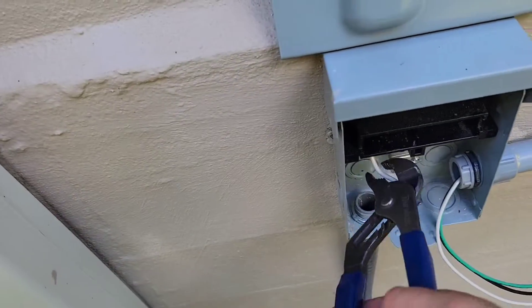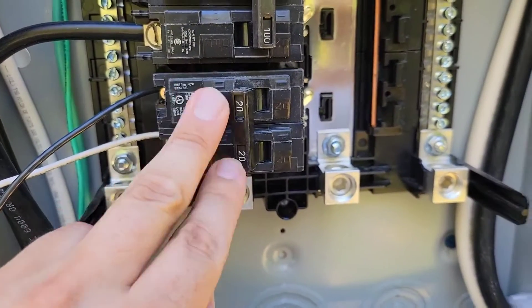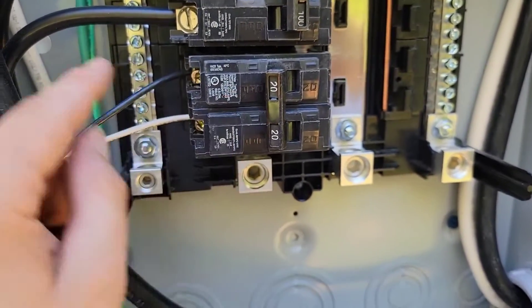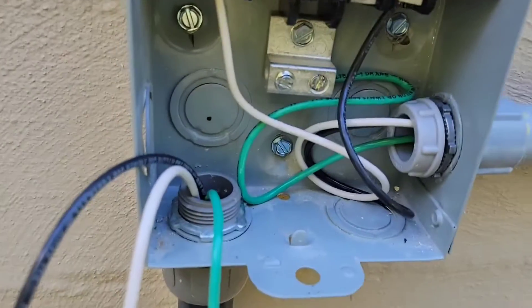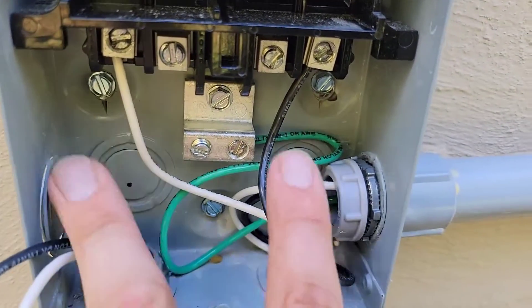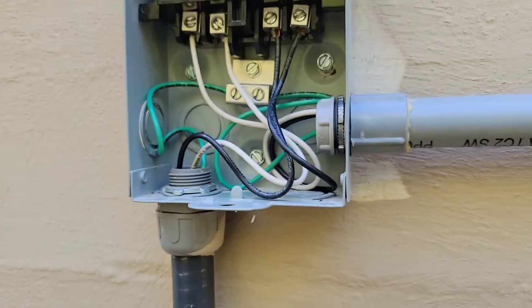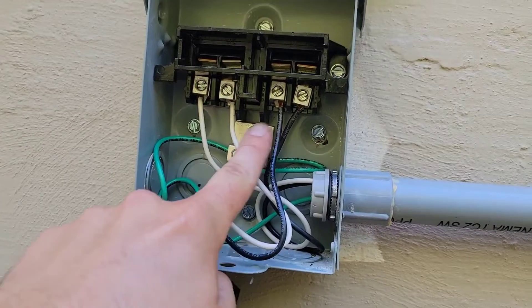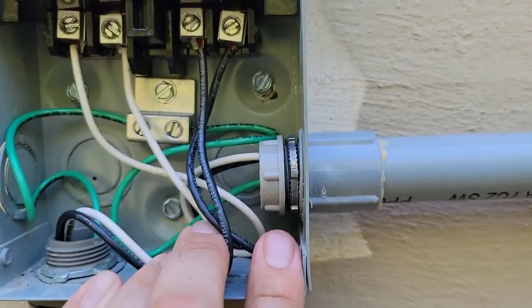Go ahead and run our new wire. Let's go over the wiring now. We got our black and our white stranded wire hooked up to our breaker here — double pole. If it was 110, we'd have a single pole breaker, and this black would be on that single pole breaker, and then the white would be on the neutral, and then there'd be a ground wire — which is the green wire usually — and it would go to the ground bar. That's how you wire up 110. Got the breaker installed, and this is how we wired the disconnect. Our wires are hooked up to the line — one here, one here — and that's our input power to the disconnect, and this is going to be our output. You can see that these wires right here are going in the middle, and this is the load. We've got our grounds hooked up and we've got our little bushing here — a little plastic bushing. You have to have that as well, part of the code.